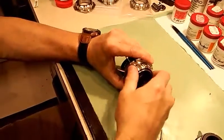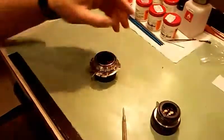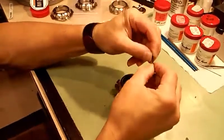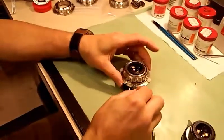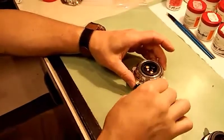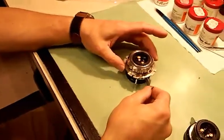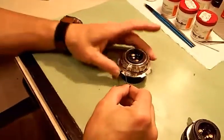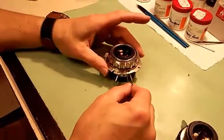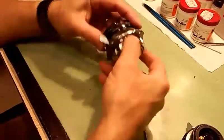Now I'm going to back this ring right up to it. Once it's up in place, I have some M2.5 set screws — four of them — and I will just place those around the perimeter. When you're installing, put all four set screws in and just snug them a touch. Don't snug them very much. Then go around and just give them just a touch more of a snug all the way around.